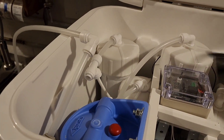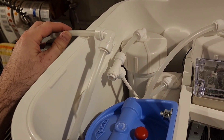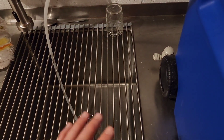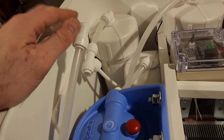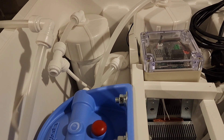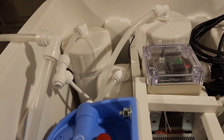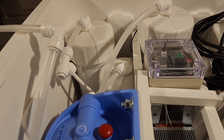We've got that hooked up and we're just about ready to go. You want to make sure both your permeate and your concentrate lines are also flushing off into your sink or drain so you can reject all that — again, 10 minutes. Then we're going to run probably about two hours of fresh water through here and get hopefully a couple hundred gallons through the system to rinse it all out. At the end of that we will check our chlorine as well as our pH.